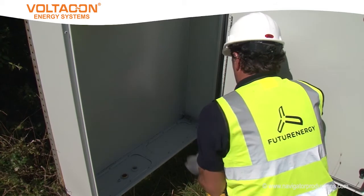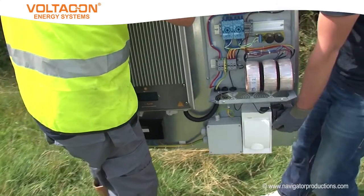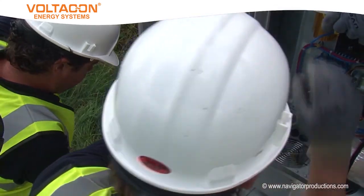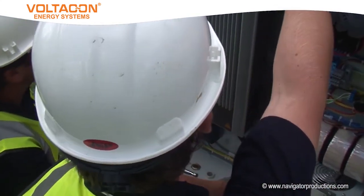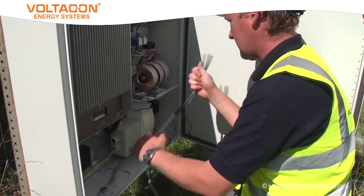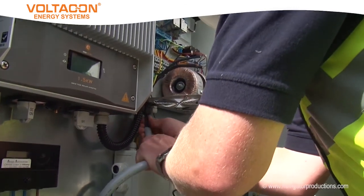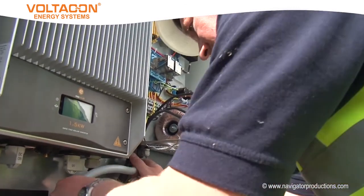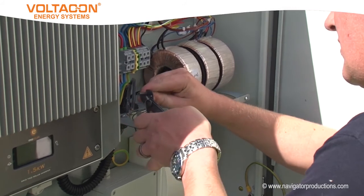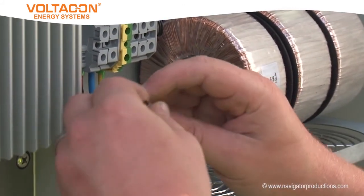Before the tower is lifted, the control panel must be installed and the cables from the turbine connected. This is to ensure that the default no-power safe mode is activated, where electrical contactors naturally short the connections of the turbine together, meaning that any rotation of the turbine will cause an equal and opposite electromagnetic force opposing any turn, so causing a natural braking effect.